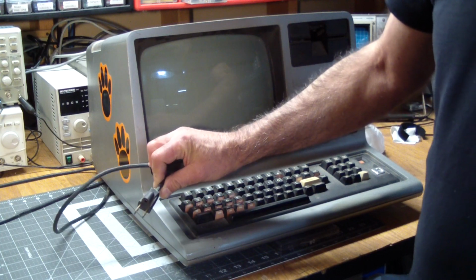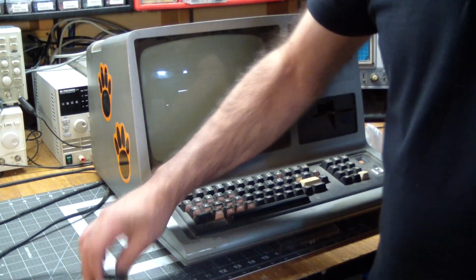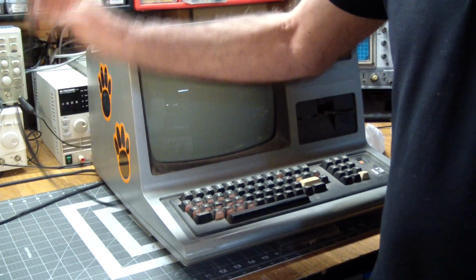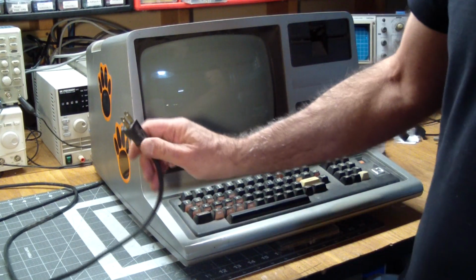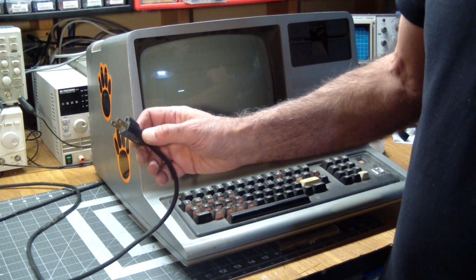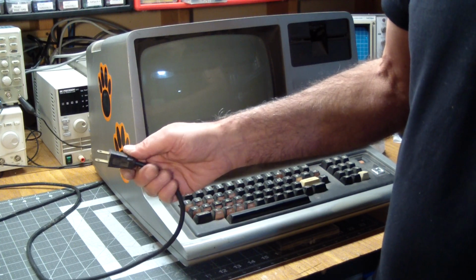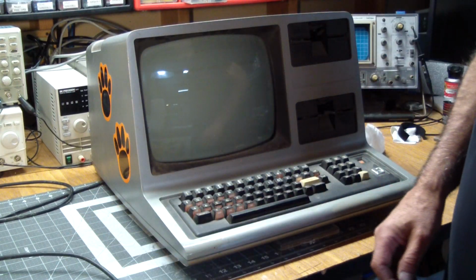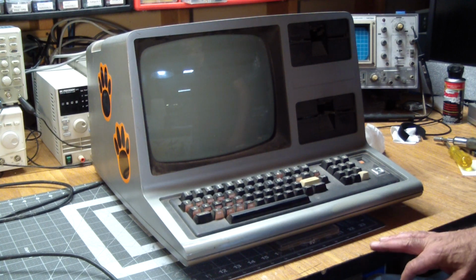Furthermore, her ground lug has been amputated, which is a really bad idea. Even though the neutral and hot plugs are polarized, without the ground lug and using enough force, you can put it in either this way or this way. And if you invert hot with ground with neutral, bad things will happen.